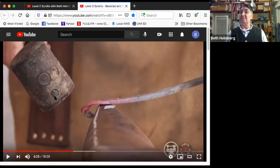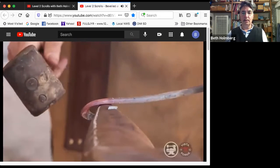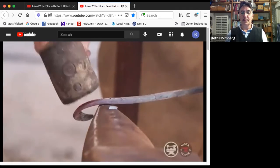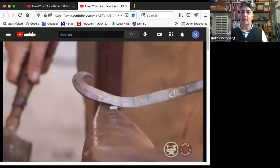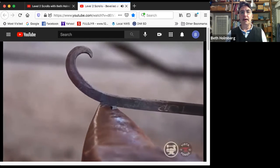And frankly, a good blow from the hide mallet works perfectly fine. There's a little bit of stink from it burning, but it works well. And as usual, look, I'm holding it at an angle, the angle I want my metal to bend down to. So going around a little bit further, making sure it's square around, and I'm kind of out of heat. So I'll stop right about there.